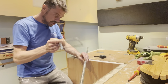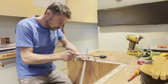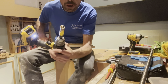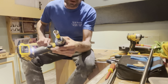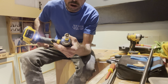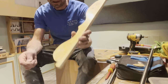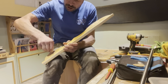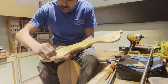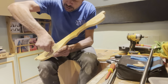Now I need to cut this into two bits of three foot. With the hole cutter, this makes sure the tube clamps in place — it doesn't take out the whole hole, it just makes a hole. What I then do is go through with a small drill bit and just scrape out the bits and widen it slightly so the tube fits in nice and securely.